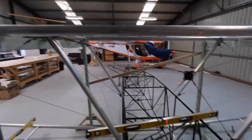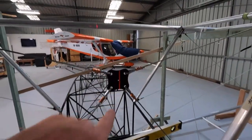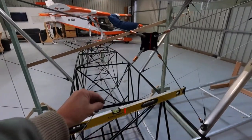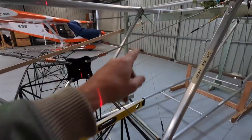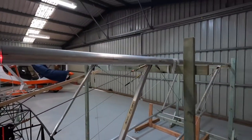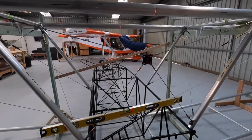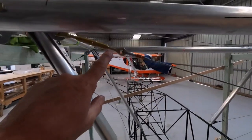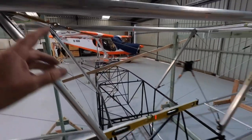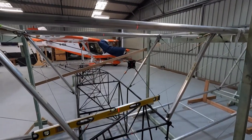That's a bit harder than it looks. With my laser — I'll accept that. So it's in the centre. I've got tension on these. Because you've only got two turnbuckles, it's a bit hard — probably needed four turnbuckles. But anyway, I've got to stop on the turnbuckles somewhere. The only issue is I'm right on the three-thread limit — might even be four there. What I might just try is take the whole thing and swap it around, see what happens.